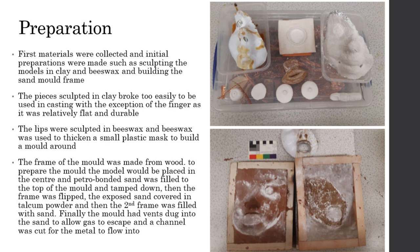The frame of the mold was made with small lengths of wood. The oil-bonded sand used in sand casting sticks tightly together and can be compressed so that it can be built around a model and retain shape during the casting process. The model is placed in a frame and sand is layered over top and tamped down until it's firm. The frame is then flipped over and the whole thing covered in talcum powder so that the next layer of sand does not fuse with the previous layer. Once the mold is built and the model is removed, channels are cut into the sand for the molten metal to flow in, along with holes for gases to escape. The final product is a negative space into which metal can be poured, creating a new cast.